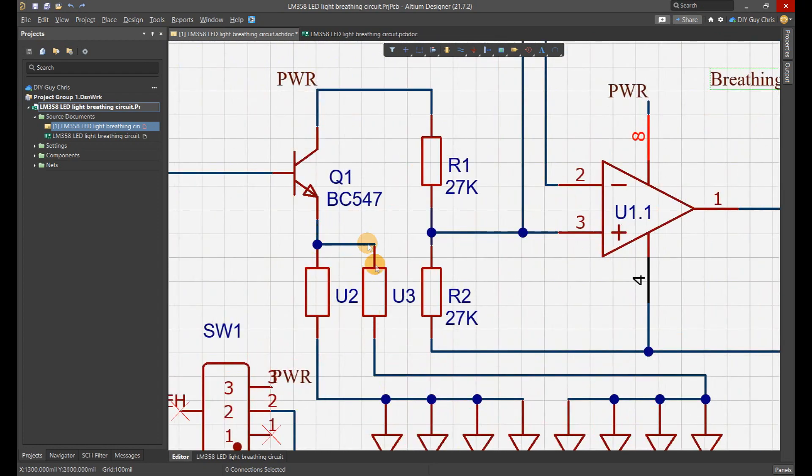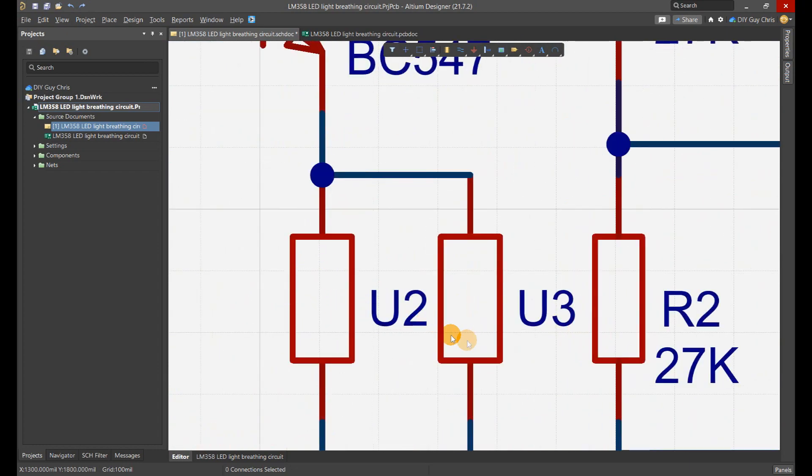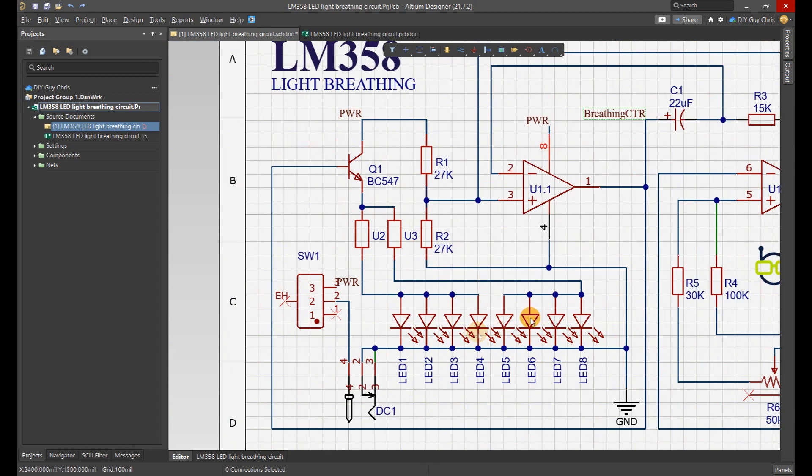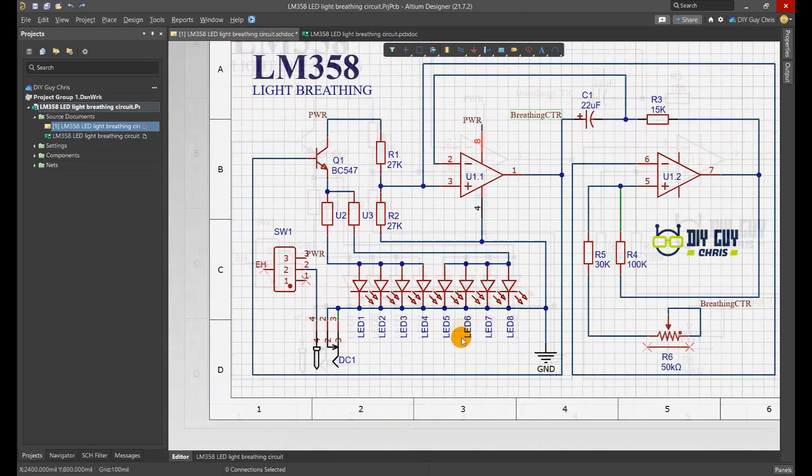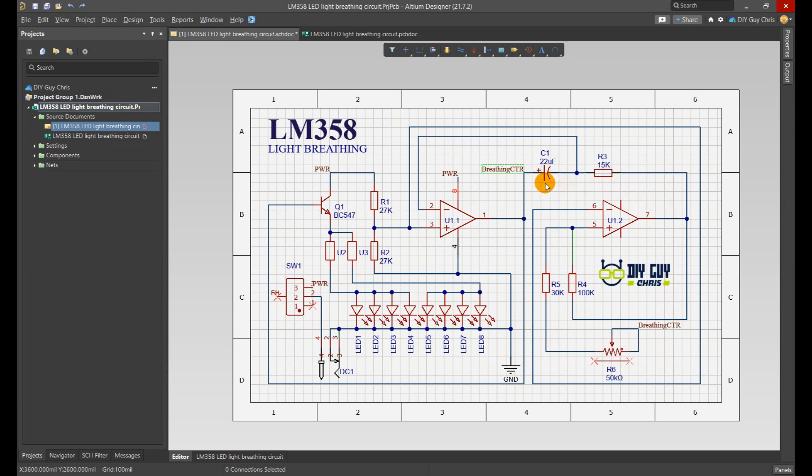The output is divided into two groups of LEDs, where I placed one ballast resistor for each LED group. I still recommend connecting your LEDs in series when dealing with a large LED count, or placing one ballast resistor per LED to ensure equal current flow and brightness for all LEDs.